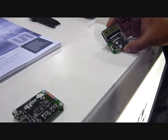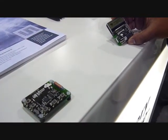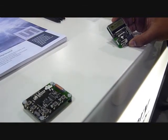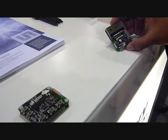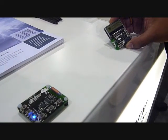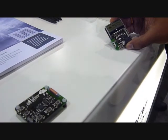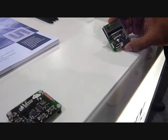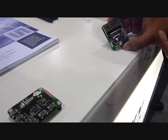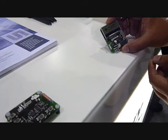This is a very brand new product that we just released about a month ago, and we're seeing a lot of interest from a lot of different applications. This chip operates in listening mode at only 60 microamps, so it's very low power with a high level of integration. We have a proprietary algorithm integrated inside the chip that enables us to determine whether a lightning signature was a real lightning signature or whether it's a man-made signature.